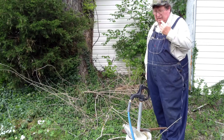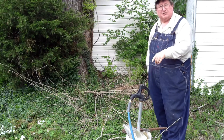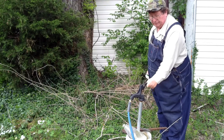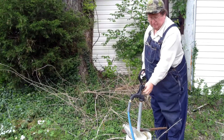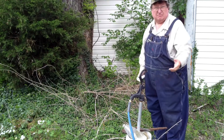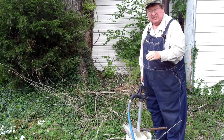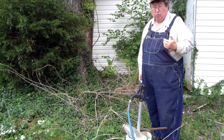Welcome back to College Hill Farm. Well, today I've got a little problem. This frost-free hydrant is leaking — not down in the ground, but up here. When you turn it off, it leaks right here at where the stem goes in. It's been leaking there for quite a while. In typical homesteader fashion I've just dealt with it, but now when you cut it off it's leaking all the way down, letting me know that the little plunger at the bottom is not working anymore.